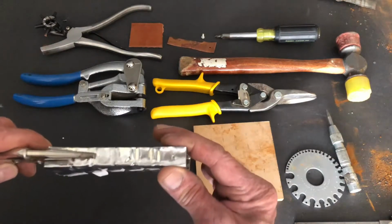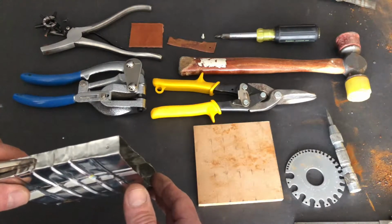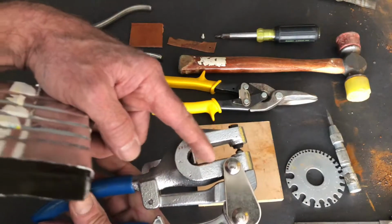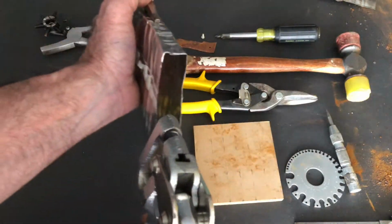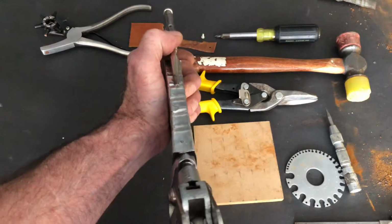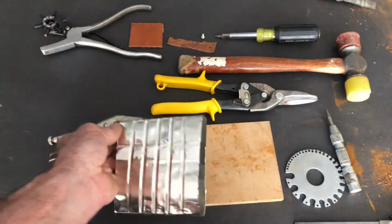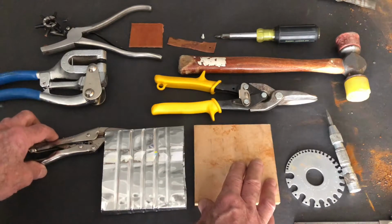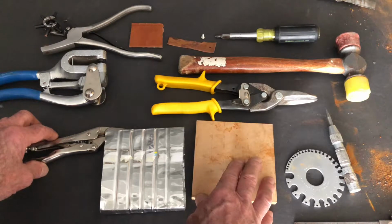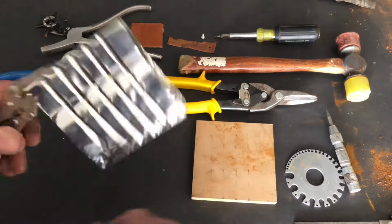because this material is so prone to bending and I'm unable to effectively use a center punch on it, I might also find that I have limitations with hand punches, which can only go in as deep as what's called their throat. In this case, the stock is too narrow for me to get the die side inside of that form itself. So what are my options? Well, I could buck it up on a piece of wood, or I could also use a step bit, or I could open up my form.